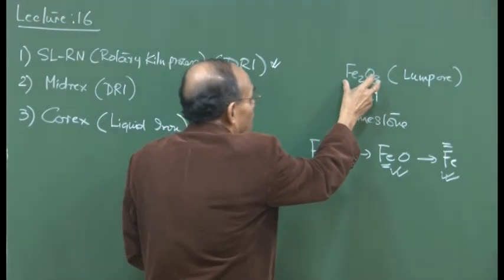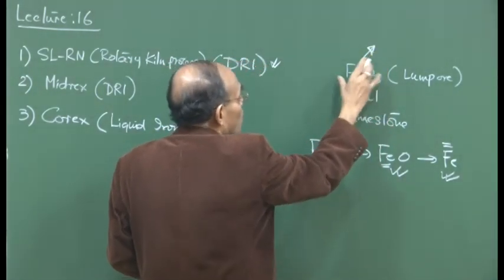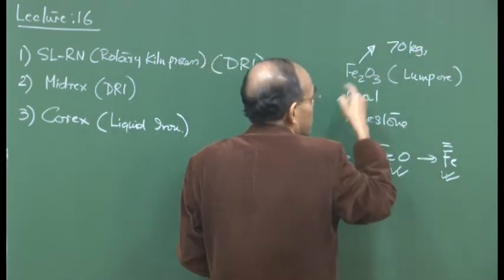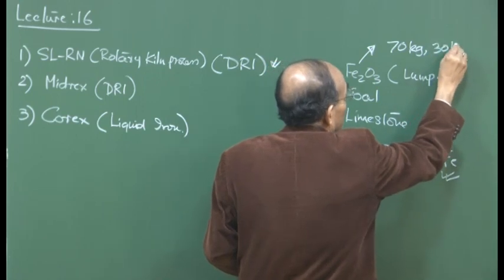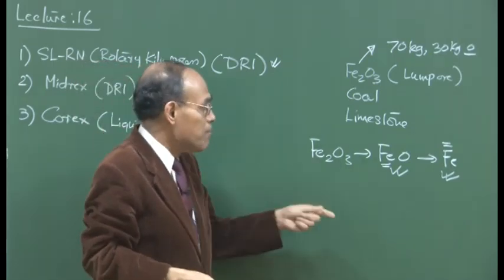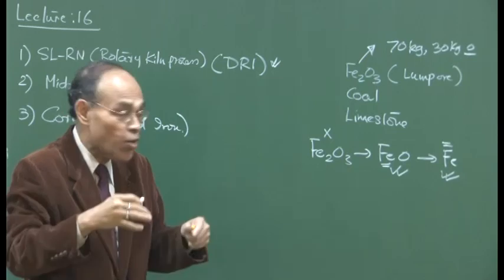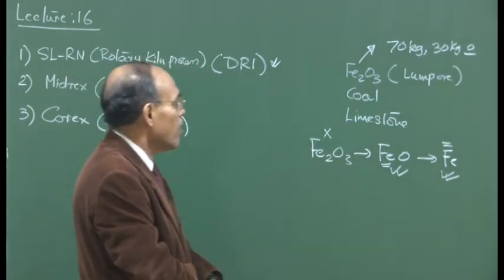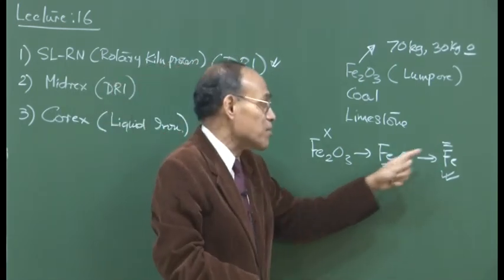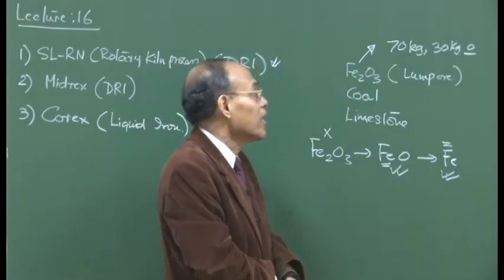If I sell iron ore, it is understood that if it is a pure material, in 100 kg of Fe2O3, I have 70 kg of iron and 30 kg of oxygen. That is what it is. And when you have a DRI, this oxygen is virtually non-existent in DRI, because you have subjected it to a high temperature in the presence of a reducing environment. So you will get some reduction done. Reduction is nevertheless not complete. So it is going to be a mixture of FeO and Fe in the whole product.